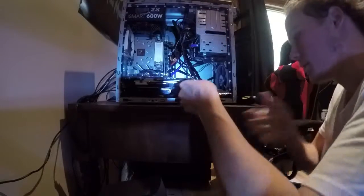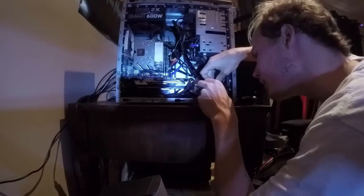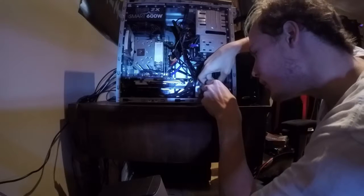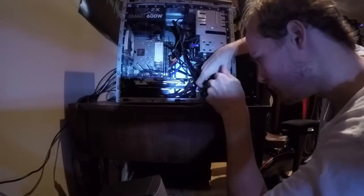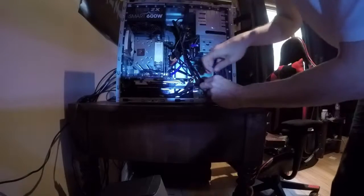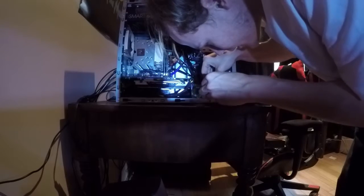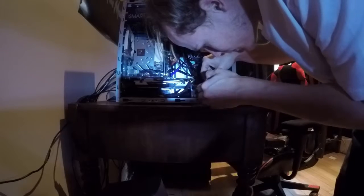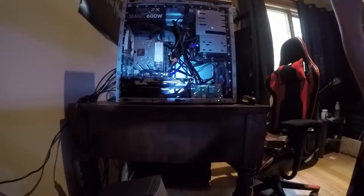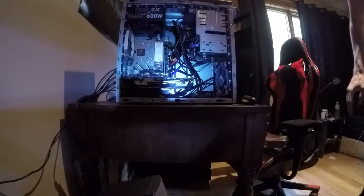It's normally open and common — polarity doesn't matter, we just need one and one connected to one and one. It's a bit of an awkward angle but we got one in and we're going to screw it down. There's one good connection made — now connection two goes right in there. Now I just realized the power supply in the computer itself is not going to be on unless the computer is on, so most likely you're going to have to plug this relay into an external power source.